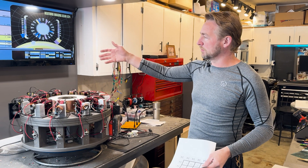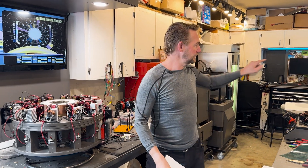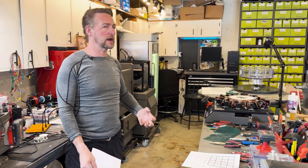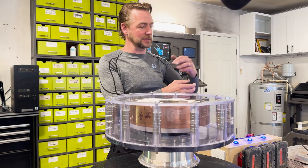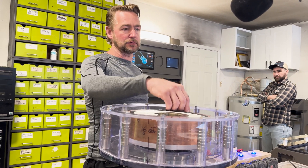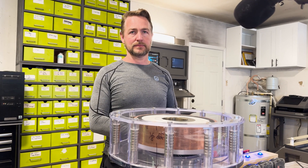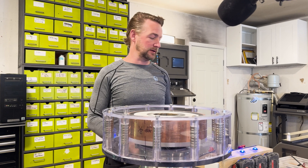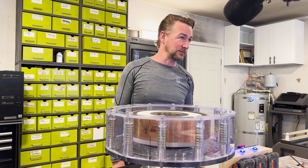My main goal with this is I really want to max this out to get up to 500 RPM. This can't do it, but that can go way beyond 500 RPM. 500 to 600 RPM was our goal and we way surpassed it. As it spins up it doesn't need so much power, so it'll kind of lose it, but you'll hear a drop in sound and then typically the roller flies off. So this is just your standard roller — spin this up and at a certain RPM it'll go quieter, probably around 570 to 580 RPM.